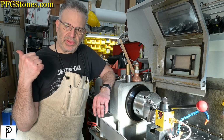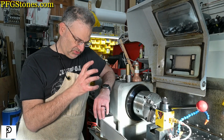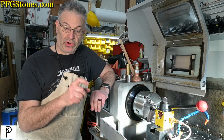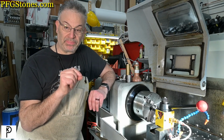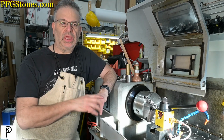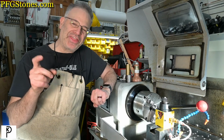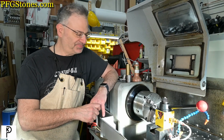Here, we threw out those pins from the T-nut and we drilled and bored two holes to put pins in to directly locate the tool post. And it came out really great, and we learned a bunch of things. The combination of the Criterion boring head with the MariTool quarter inch boring bar and the very sharp inserts that they say are for aluminum was a huge win. One of my philosophies is that those sharp inserts are fine inserts and the other ones are coarse inserts. And that was proven out today yet again.